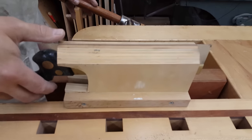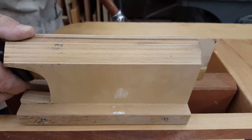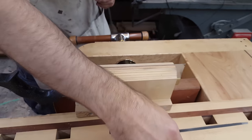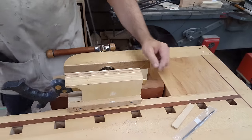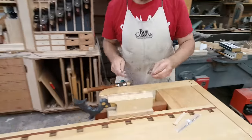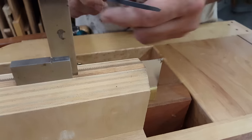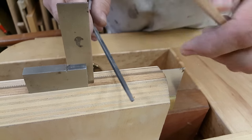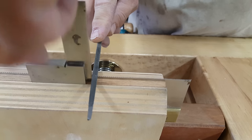You want them well supported. Now my dovetail teeth, and most, are pitched at about zero degrees, meaning the cutting face of the tooth is standing plumb. So what I do is I use either a four or a five inch double extra slim taper file. I get a piece of popsicle stick or a thin piece of wood with a hole drilled in it. What I'm going to do is set this on there, and I'm working on this side. So it's this side that I'm going to be working against. The tooth on this side is actually what's doing the cutting. So I'm going to put that file in there, move the square over to it so that it's standing plumb. That's one side of standing plumb.